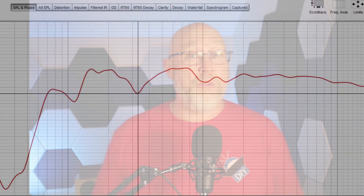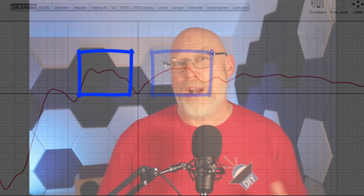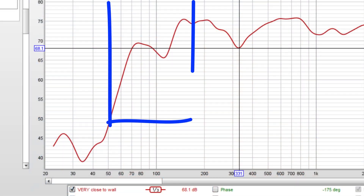After running a sweep, we see a mostly flat response except for two peaks and a dip around 320–330 Hz. The difference between those peaks and that null is about 7.5 dB. You'll also notice that at frequencies below about 150 Hz the bass rolls off quite rapidly — this is what you should expect from a four-inch driver.